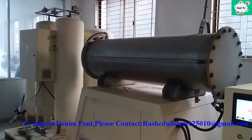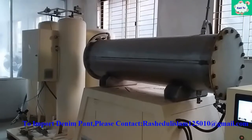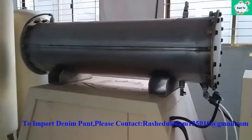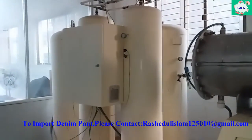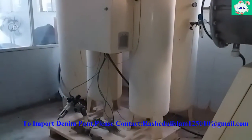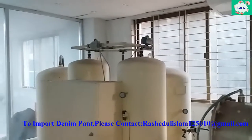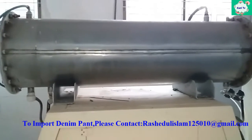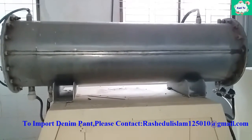Now let's learn the most important thing: the mechanism of the ozone machine. This is the main chamber of the ozone machine from where ozone is supplied. You can see here four cylinders. The first cylinder collects air from the environment. The second and third cylinders dispel other compounds from the air and collect pure oxygen. Finally, the pure oxygen is sent to the fourth cylinder. This is the main part of the ozone machine where ozone is produced.